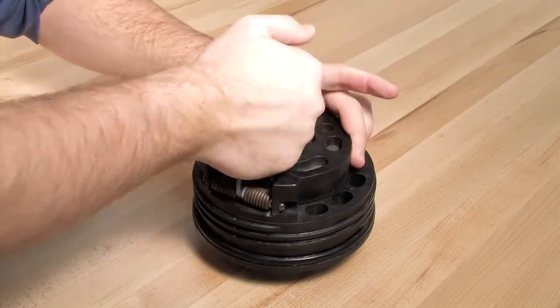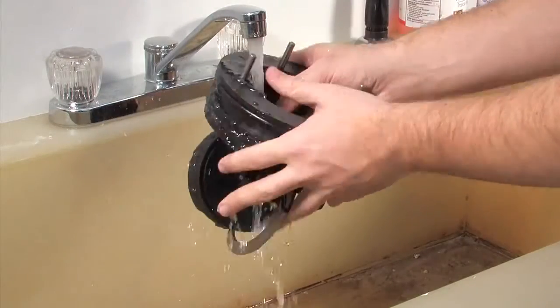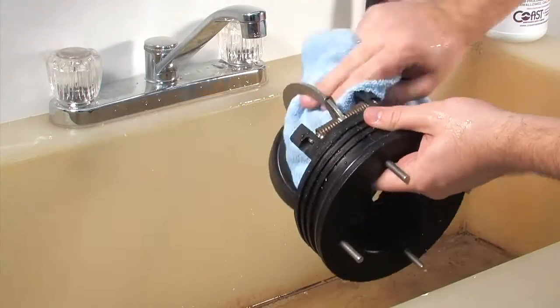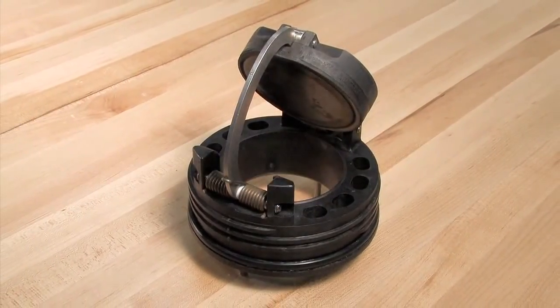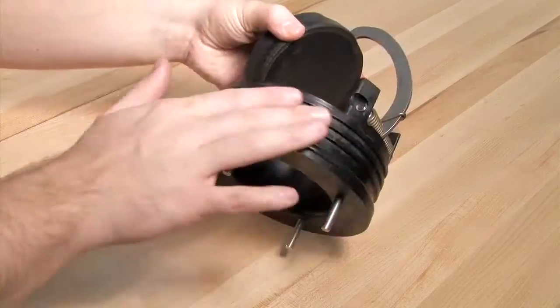Checks found in the two and a half to four inch modules can be opened by hand. Begin your inspection by cleaning the check module with water to remove any dirt or debris. Once clean, thoroughly dry the module before proceeding with the inspection. In many cases, damage or deeply embedded debris may be invisible to the naked eye and can only be detected by close examination and touch.